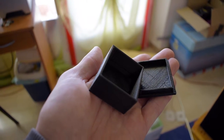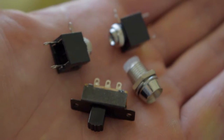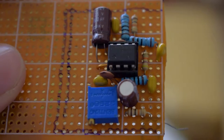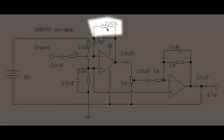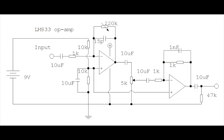To contain all the electronics, I've asked a friend to 3D print this tiny box, on which I will mount a volume pot, in-out female jack connectors, LED housing, and a power switch. Internally, it will contain this circuit board — link below. This is a two-stage inverting op-amp amplifier with a variable gain given by the trimmer and a variable output volume. In this configuration, the max gain is 52dB, which will be set to 20dB later to avoid clipping.